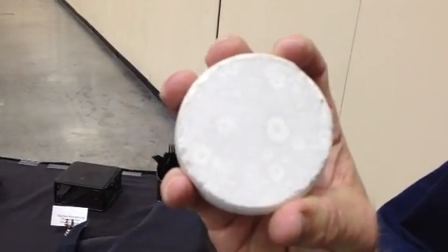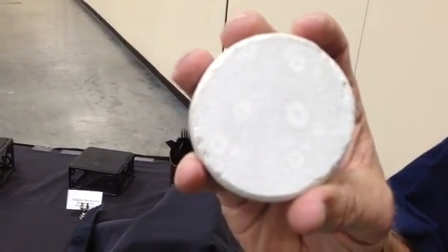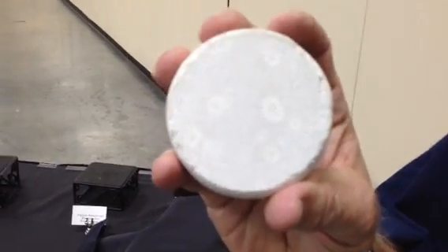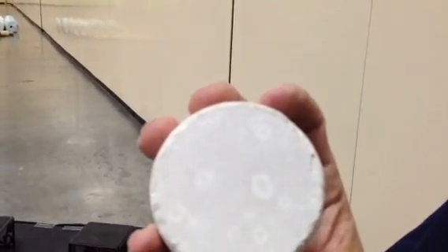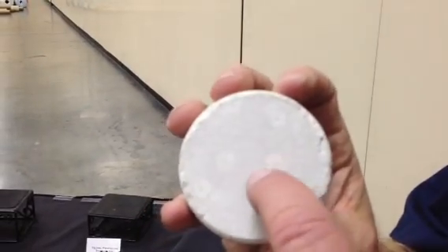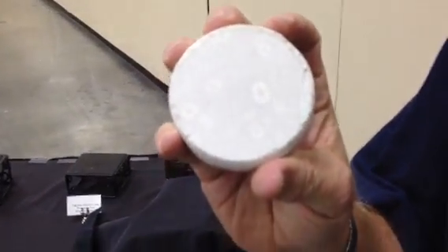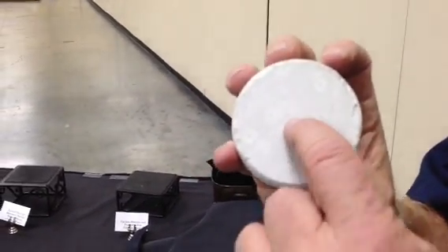What we have decided to do is to take these cores that had a few spots within the middle, and to send them to four different professional independent cement laboratories across the country and have them perform a failure analysis. They will use scanning electron microscopy and do cross-sections to analyze why the spots are different than the surrounding areas, and also address the overall grain, which would appear more gray if this sample was underwater — there would be a much brighter contrast between the white spots and the gray areas around it.